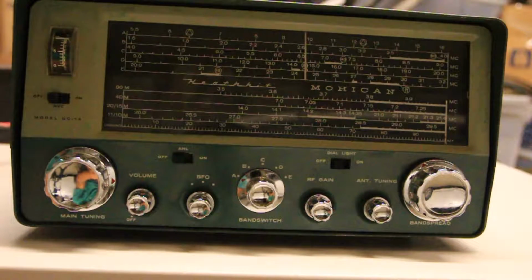And you'll see that on a lot of old radios, particularly tube radios. You have to do that with your radio, and that actually makes it so it matches the impedance of pretty much anything out there, you know, within a certain range. Definitely, it doesn't have to be exactly 50 ohms.